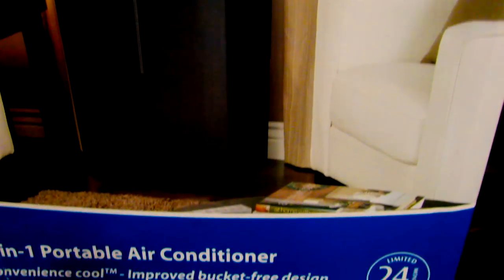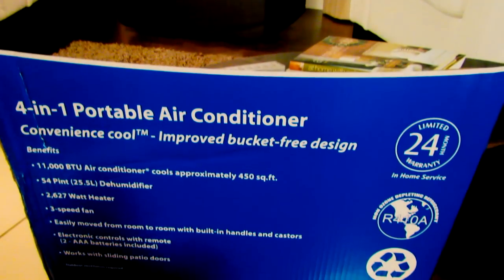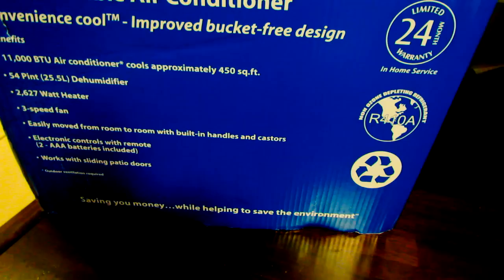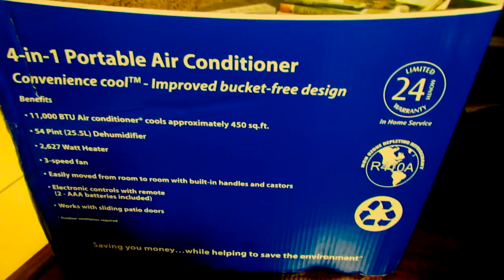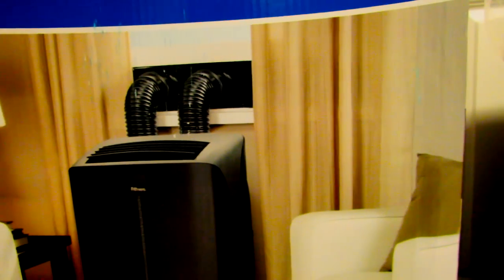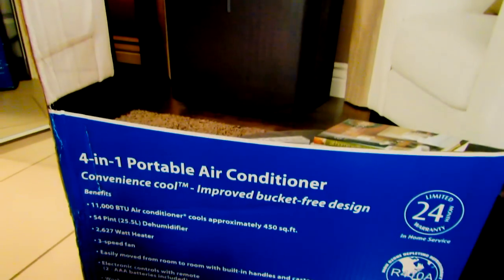It's a 2-hose system. You can remove one of the hoses and then it'll just become a 1-hose system where it exhausts outside and then you get makeup air through the hose. So it becomes the exhaust fan. So with the 2-hose system you can use it as a 1-hose system. It won't be as efficient, but it'll still work. So it gives you that extra functionality.